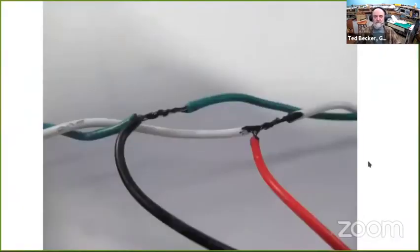I said this bus is a twisted pair. I bought a 100-foot spool of each of these 24-gauge solid wire. I clamped one end of them in the vise, unspooled all 100 feet out the length of my driveway, chucked them in the electric drill, and twisted them. And then I ended up stringing it around my layout. My layout is sort of a J shape. So I strung this around the layout, and what I have installed on the layout is about 60 feet of that.